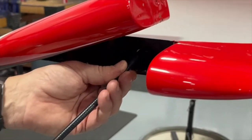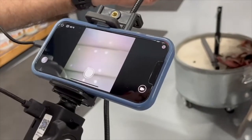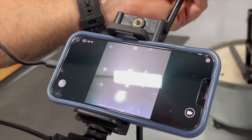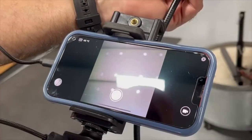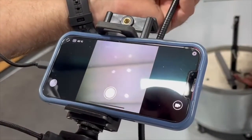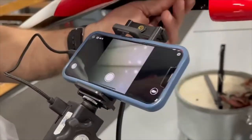I'm going to try and get it here — we did get a clear picture earlier, so we will show you. You can see as we zoom in, you can see the borescope does a very nice job of being able to see all four rivets on the outboard hinge bracket. Unfortunately, we have a crack here. We'll show you the clarity with a still shot in the video.